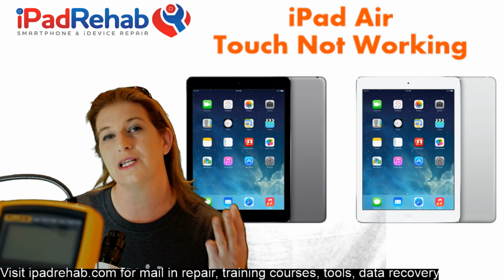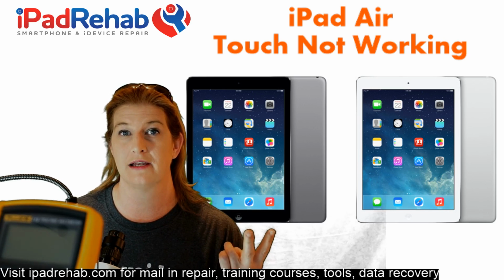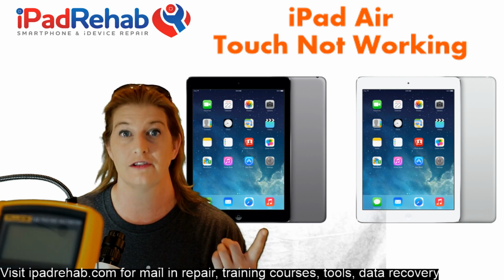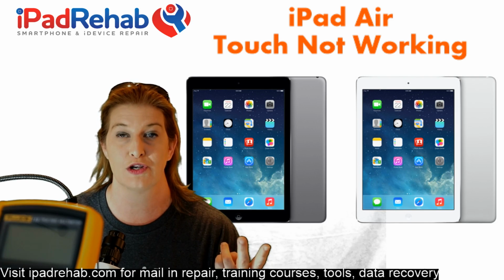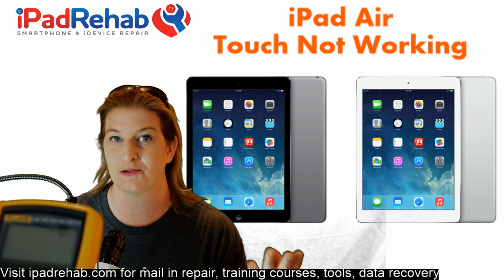There's always three choices when we know a line is not working. Either it's short to ground, it's an open line, or it's never produced. So it's one of those three, and there's no other possibility. It's short to ground, it's not arriving at its destination because of a broken open line, or it was never produced. Those are the only three possibilities, so it could be any one of those three.